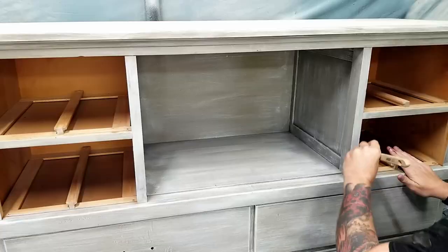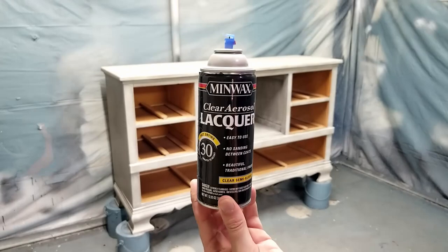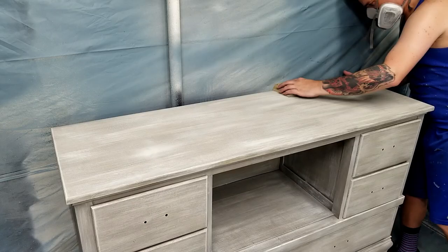Now that all of the painting is out of the way I can finally top coat this piece. I'm using the same Minwax aerosol lacquer as before except this time it's in a semi-gloss to give this piece just a little bit of a sheen. When top coating with aerosol lacquer I'll apply about three thin coats, then come back with 320 grit sandpaper to knock it down and get it smooth, then come back with a fourth final coat where I'll move my hand slower and hold the can closer to the surface, giving me a very smooth finish.